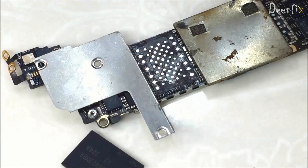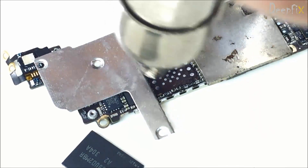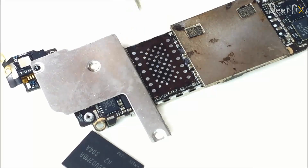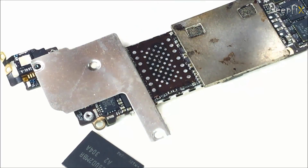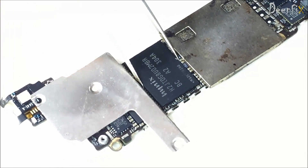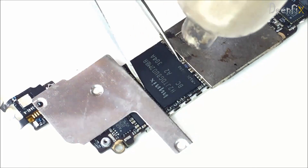I am going to replace the HDD or U4 first. I took these three ICs from a physically damaged board. Make sure that donor phone does not have iCloud. Make sure of that. Remove the ICs from that board and replace them onto your iCloud-locked board.